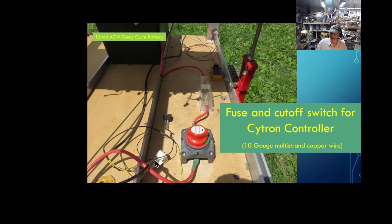These are the switches I had earlier on when I was first experimenting and learning how the wiring of the Ryobi mower logic worked. One was just a momentary switch, and one's off and on for the safety switch. I'm using a 12-volt AGM cycle battery. I get several hours of runtime out of that. That's why I don't think I'm going to be adding a second one.